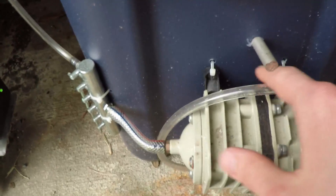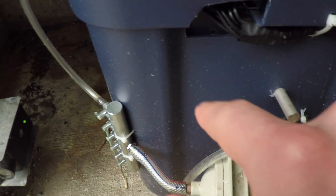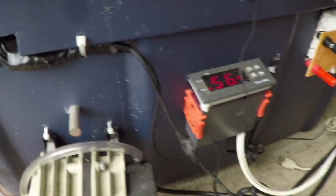In the bath there's a heating element and a submersible pump underneath. What I've done is take two Rubbermaid containers. You can see there are actually two containers. The internal container keeps the watertight integrity of the heating bath, and the outside allows me to drill holes and mount the different components onto the outside of the tank.